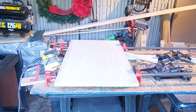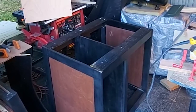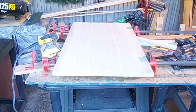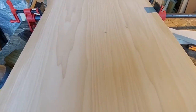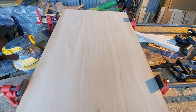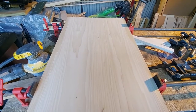All right, now I gotta tell you, for Home Depot boards and an old table saw, gluing those two pieces together, using my table saw to give me a clean edge because I don't have a jointer. I mean, if we take a close look, you can see where my seam is, but it actually did a really good job at closing up that gap. You don't think you can tell where the joint is. So all I gotta do is cut 12 inches off this board, and that will give me my front computer flipper door. Pretty cool.